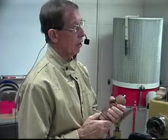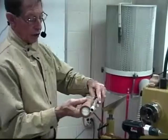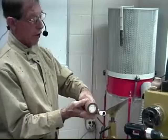First couple coats, you can wait 4 or 5 hours, 6 hours, because it soaks in pretty good. And then after that, I just do it once a day. I've got a Four Seasons room. It gets up to 80 in there. And when I put poly on them, I just take a dowel on the workbench without the kit in. You just slide the parts on your dowel. Then you can wipe them, and you're not touching either end. You know, they're separate. And I just carry the dowel up, put it on a rack in the sunroom, and let it dry. Take it back in the basement the next day and let it dry.